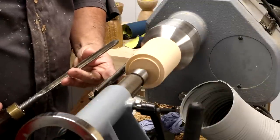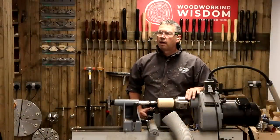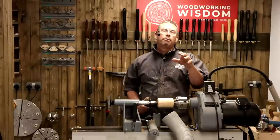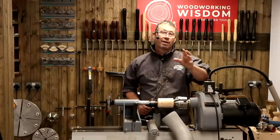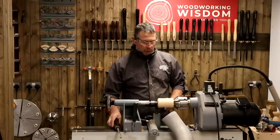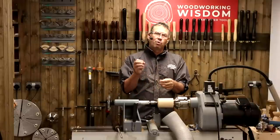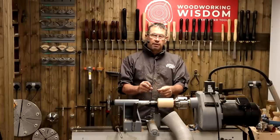Yes, Ben. Sorry, Colwin. A couple of questions. We've got one from Mark. Is the sanding sealer diluted or full strength? Diluted. I always dilute mine between 50 to 70% sealer, and then the rest in thinners. That's my preference. Every time I do that within earshot of the manufacturers, they tell me no, you don't need it, it can be used straight out of the tin. Well, it might be able to be used straight out of the tin, but when you thin it, it soaks further in and it'll dry much quicker, and that wins for me every time.